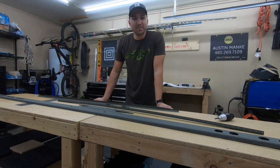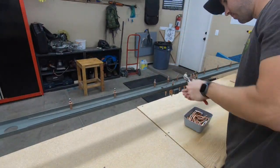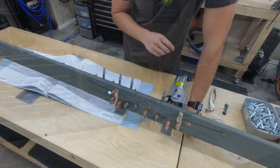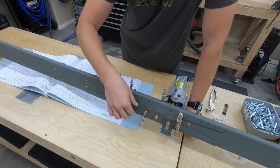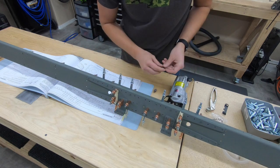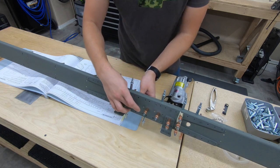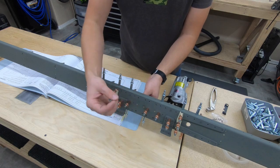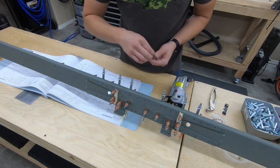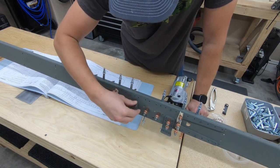I'll quit talking and we'll get to building an airplane part. Here's something I learned that helps out quite a bit when it comes to these countersunk portions. When you go to prime it, the primer actually builds up quite a thick layer, so when I go to put this countersunk rivet in, it's going to stand far more proud than it should — enough of a standoff that I'd want to countersink it further. But when I had countersunk it prior to priming, it fit perfectly. So just use a little countersink cutter head and spin it by hand, and it'll knock off just the right amount of paint.